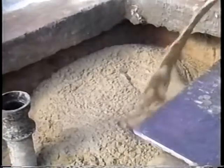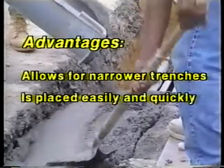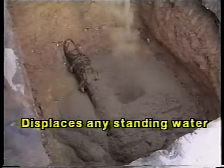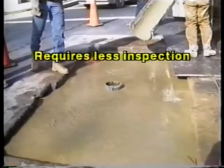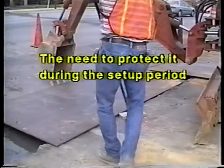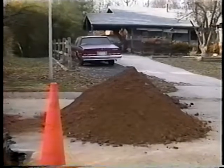Non-shrink fill, also called unshrinkable fill and flowable fill, is an alternative to soil backfill. It's a concrete-like mixture, minus the coarse aggregate, and with enough water to make it flow readily. The advantages of non-shrink fill are that it allows for narrower trenches, is placed easily and quickly, easily flows into and fills hard-to-reach areas, displaces any standing water, self-consolidates, attains maximum density, doesn't settle, can be dug up, and requires less inspection. Disadvantages include its non-availability at times and in some locations, and the need to protect it during the setup period. Steel plates are probably the best means of protection during setup. Although non-shrink fill may be increasing in use, traditional soil backfill still predominates.